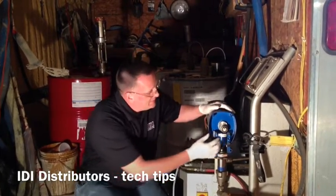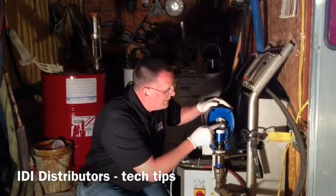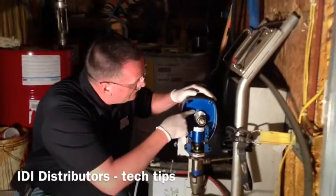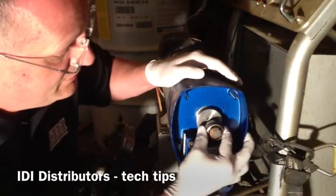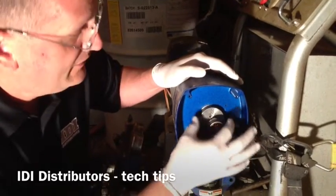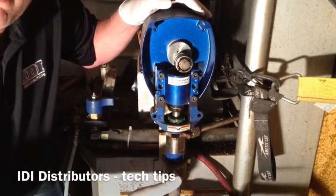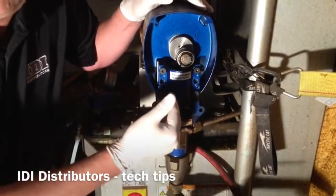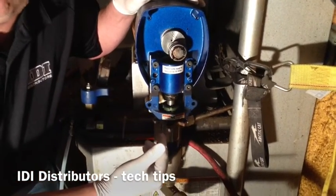The issue that we're seeing is on those connecting rods and in the gearbox — there's a bearing right here and there's another bearing right back here. What happens is those bearings go bad and they start to give movement, so that shaft doesn't get to push the pump all the way to the bottom or pull it all the way back up to the top. That side will short stroke and give you off-ratio foam.